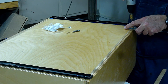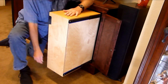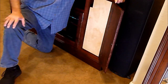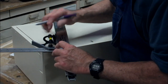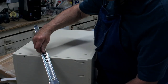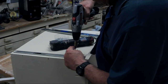The first thing we want to do is install our slides on the drawer box — this simplifies the fitting procedure. In both demonstrations, we will position one slide flush with the top and the bottom of the drawer back. To increase side-to-side stability, we will center one on the bottom of the drawer. Once the side hardware is attached, we will dry fit the drawer box in the cabinet and determine the placement for our bottom slide. Using my combo square, I determine the exact center of the slide. Alternate sides back and forth until you are marking one line on top of the other, then lock in this measurement and scribe the top and bottom of the drawer.